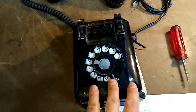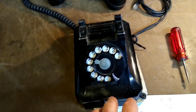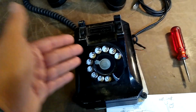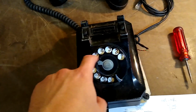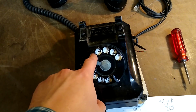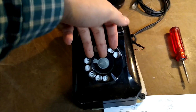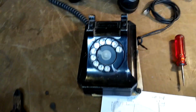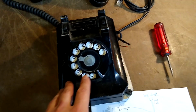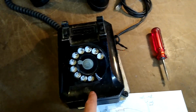Basically, there would be 3 different tones for the vertical row on a push button phone, and 4 different tones for the horizontal. When you push a button, it would switch the tones from the intersecting lines of the grid simultaneously into the line. Well, a lot of early touch-tone phones into the 90s had a switch on them that would select between pulse dialing and touch-tone dialing.